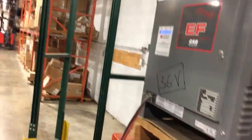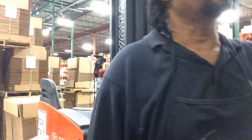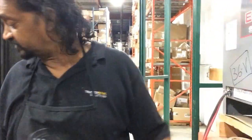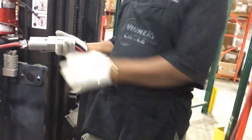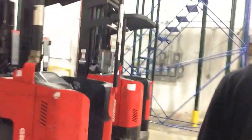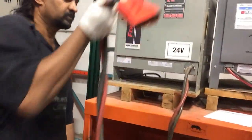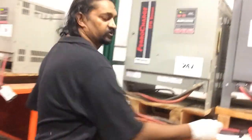That's a charger. Tell me something about the voltage. Well, we have 36 volts — some machines are 24 volts and some are 36. We always make sure that the 36-volt machines carry a gray standard plug, and the 24-volt machines carry a red plug. So it's basically idiot-proof — you can't put the plug into the wrong machine; the red cannot go into the gray socket. That takes care of the battery. You can't damage your battery or the charger that way.